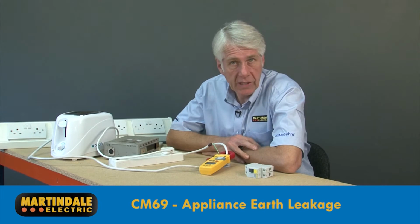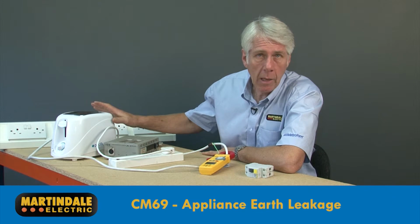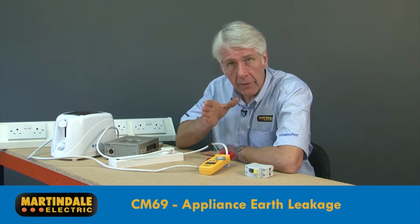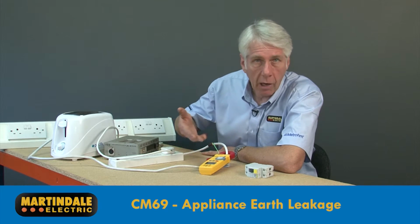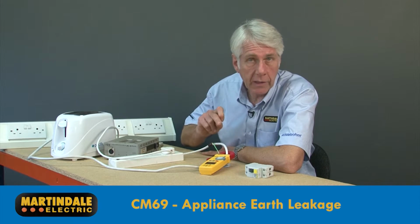We can also use the CM69 to provide an earth leakage test on individual appliances, perhaps because we suspect one of these is the cause of unwanted RCD tripping. It will be necessary to split out the conductors to do this, and here I'm going to use a modified lead. So again, clamping it around line and neutral will provide an indication of the quality of the insulation.